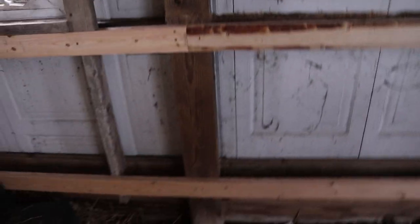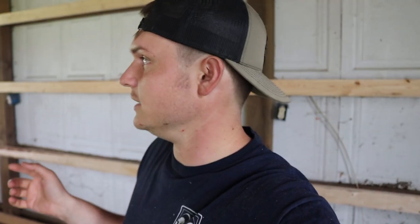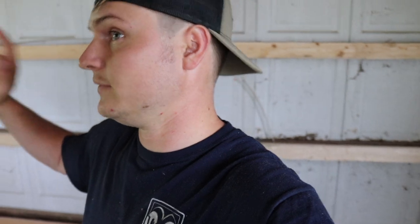I just do what I know how to do and what I think I know how to do. I ran the 2x4s down to this wall, had to notch that top corner board running all the way over. I'm going to go with the method of tacking the tin to the actual roof structure after we reinforce some stuff. Working solo, this is really an easy task — all the wall tinning, reinforcement, and hanging 2x4s can be done solo easily. The only thing you'll need help with is hanging the tin on the ceiling because of the awkward weight — you need at least two people to hold it in place to tack it.